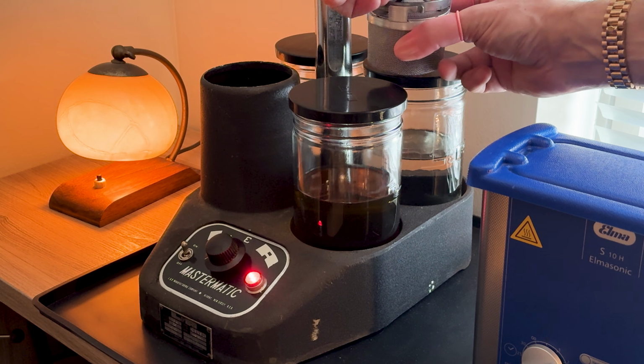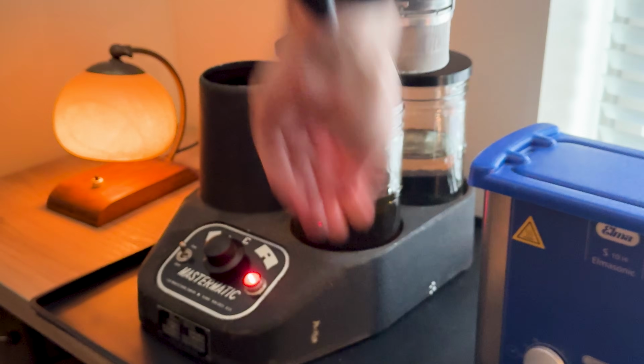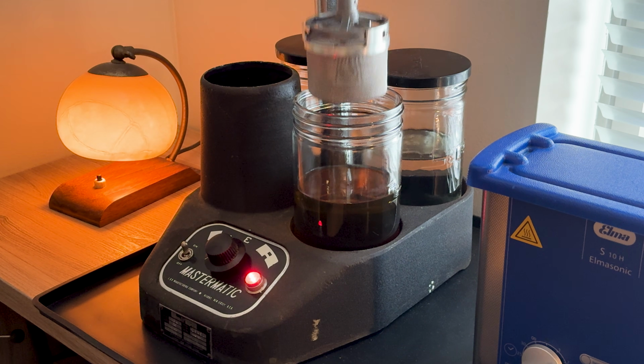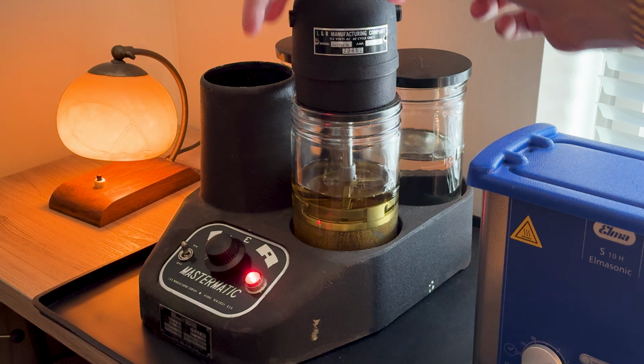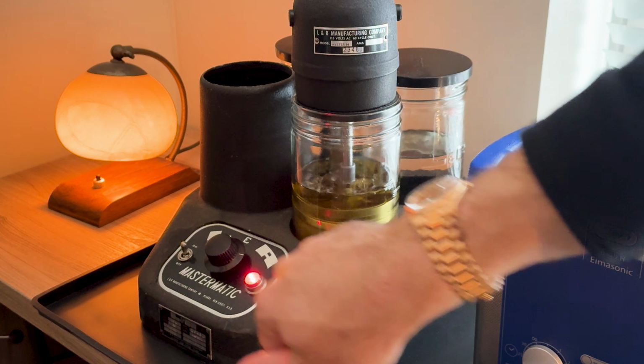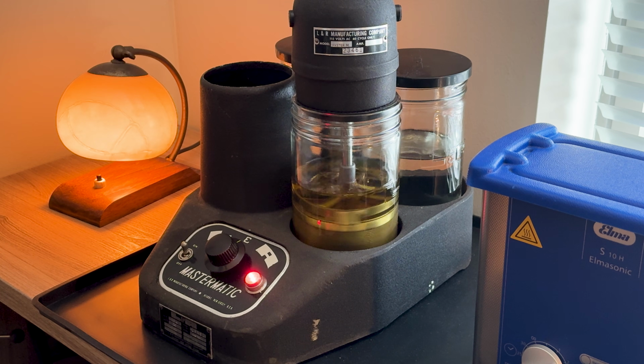Now, the one on the left there is the actual watch cleaning machine. It goes through a 3-stage cleaning process. And this is the first one. This is actually the cleaning solution itself. And then the other two are rinses. There is a 4th stage. It's a drying cycle as well. There's a heated element on that left cylinder there, and it'll dry off the parts.